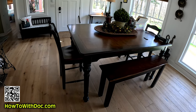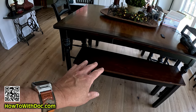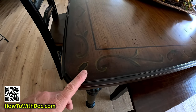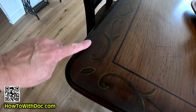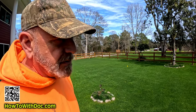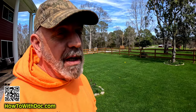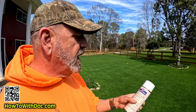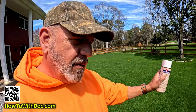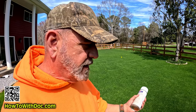Here's the finished set now, and what a difference. These were light brown and kind of ugly looking, and now they just tone in perfectly to this set because it has black legs. You can see where the manufacturer actually used a spray toner here — they faded in a dark edge with a spray toner at the factory. It's important to remember that spray toners are a transparent type toner, so they don't necessarily cover over the wood grain. I used the dark walnut first, then went back with the extra dark walnut around the edges to darken them up, and it came out absolutely perfect.